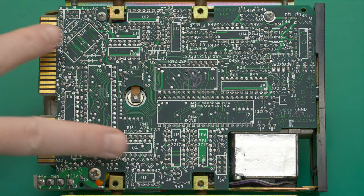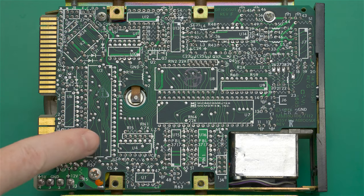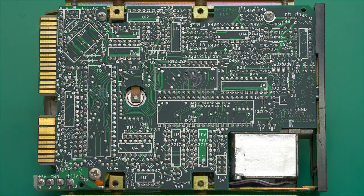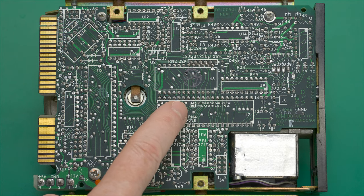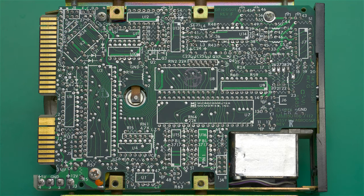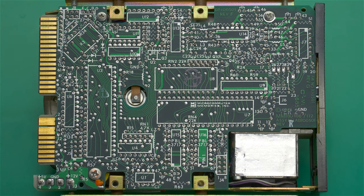So here's the bottom of the drive. We can see that the controller circuit board is here. Oftentimes on other drives you'll see components on this side, but this is exclusively the solder side. These two connectors are indicative of the ST412 interface. And we can see that the Microcomputer Memories Incorporated logo is printed on here. We also see a variety of revisions. Up here it says revision F, and then down here at the bottom it's stamped with revision K. It also has a copyright date, which is very difficult to see, but right here it says 1984.